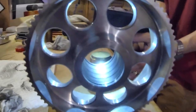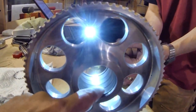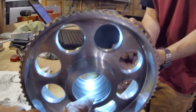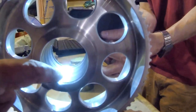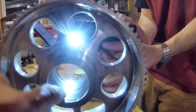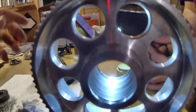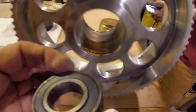Looking down inside the large pulley, you can see these grooves have been worn where the outer race has been spinning inside the pulley. That's what all that pasty black residue was — ground-up bits of aluminum stripped out of the pulley. It almost looks like these were machined to match, but it is simply the spinning of the outer race — you can see each of the four spots. The bearings themselves show very little degradation; the seals are all intact. One of them is obviously bad, but the other three are potentially not as bad.